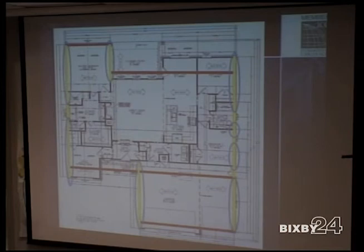The three were, do I have enough bracing? Well, you did have enough bracing there, but say you only needed 6 feet of walls for this whole wall, and you had 6.5 feet. Say that panel there qualified as enough for the whole wall line. So you could say, yes, I do have enough bracing for the whole wall line. But the second one is, I'm not within 12.5 feet from each end. Because this is my first brace wall panel, I'm 12.5 feet from here, but this side of that panel is more than 12.5 feet from this end right down here. So you can't do that. Your first brace wall panel has to be within 12.5 feet from each end. And then, they're not 25 feet on center because you don't have enough of them within 25 feet of the end of the wall.